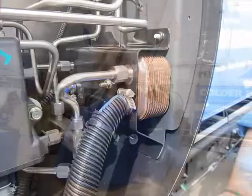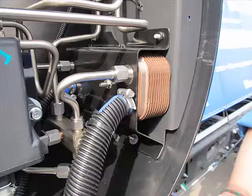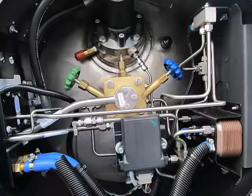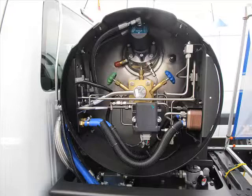What we've done is we've added a fuel pump inside the tank so we can use cold LNG. We don't depend on pressure change from liquid to gas in order to run the fuel system — we're able to use the pump to do that. We can still use saturated or warm LNG and run without the pump, or we can sense when we need the pump and use it.